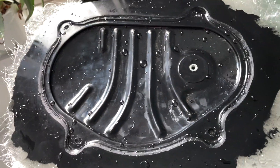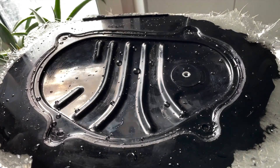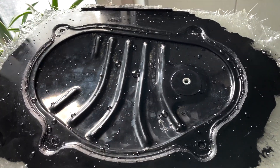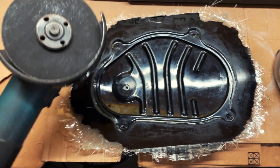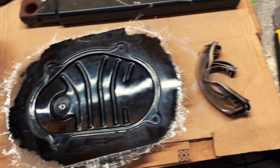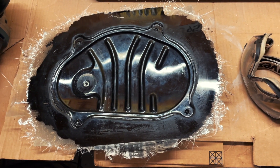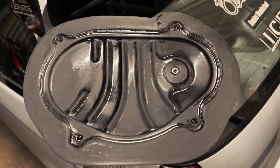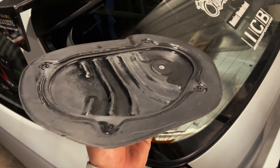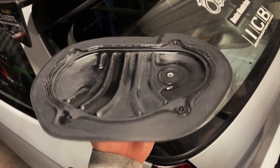After a little warm bubble bath I've removed all the wax and the PVA. This is it! There are a few damaged spots — I know where I made a mistake. Now it's time to trim the edges — always use your safety gear. I'll leave a nice flange around the part. This is it after trimming and a few seconds of sanding with 600 grit. You can see how thick the part is with the three layers of 300 gram per square meter glass.